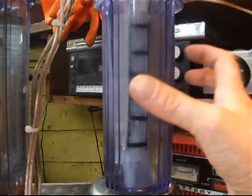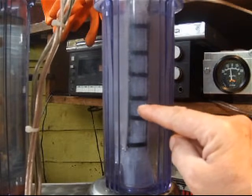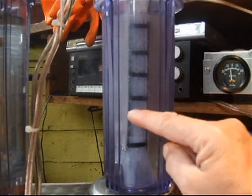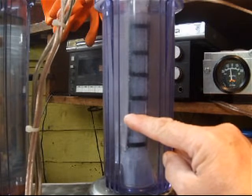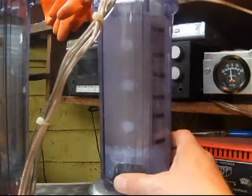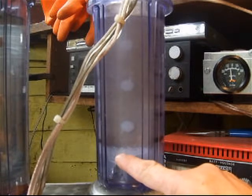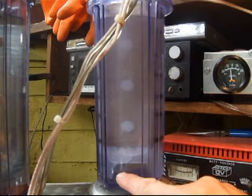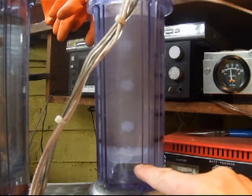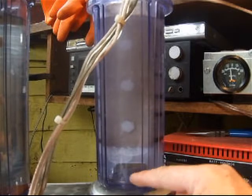It's completely isolating these negative plates from the two positives on the outside. The voltage actually travels through the bottom — the plastic comes beyond the plates so you've got about two inches at the bottom, and there's a piece cut out of the plastic there so that the voltage can permeate through the water.